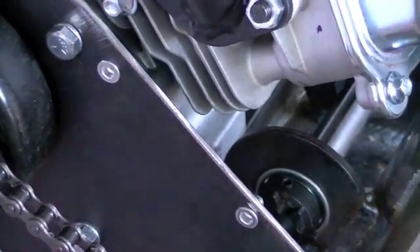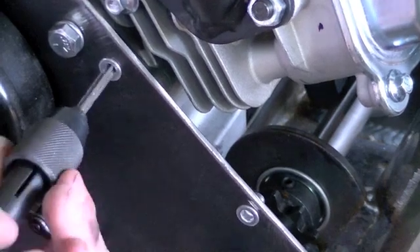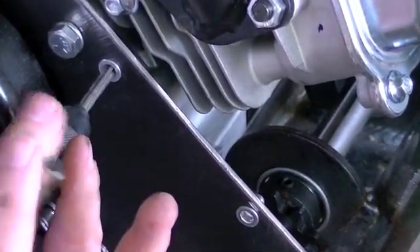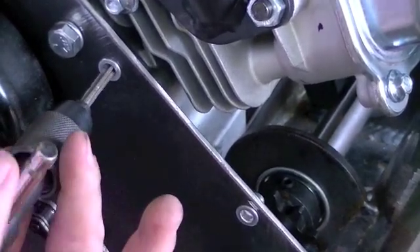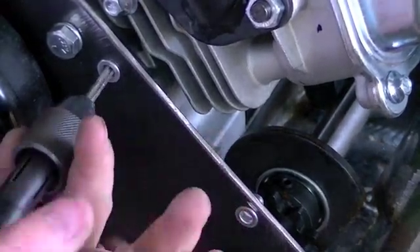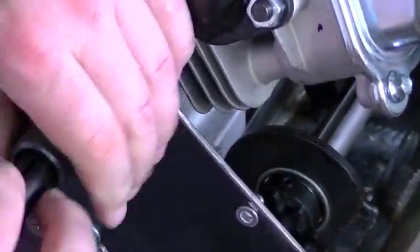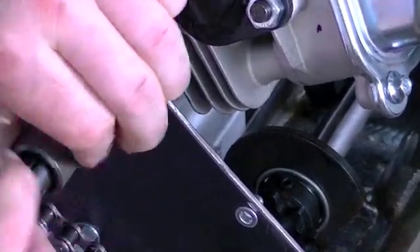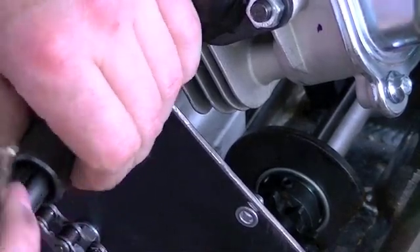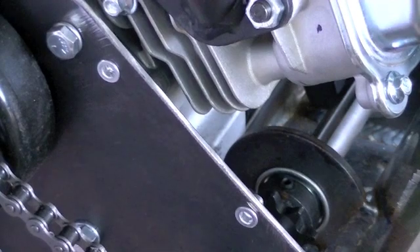Here you can see the two riv nuts that I just installed, and these are only aluminum. What I like to do is come in with the correct size tap after I'm done and just chase the threads a little bit. Now this is an actual tap — they do make a tool called a thread chaser, it's just not as sharp as this, but it is better for this kind of work. If you're careful, you can come in here with just a tap and get those threads cleaned out a little bit. A lot of the riv nuts I see are aluminum, so it's just good measure to come in here when you're done and tap them out. Chase them with a tap once you're done installing them — it just makes them a lot cleaner and your bolts go in a whole lot cleaner as well.